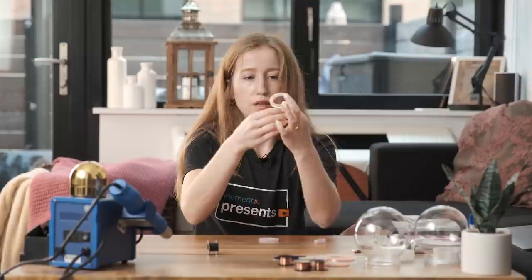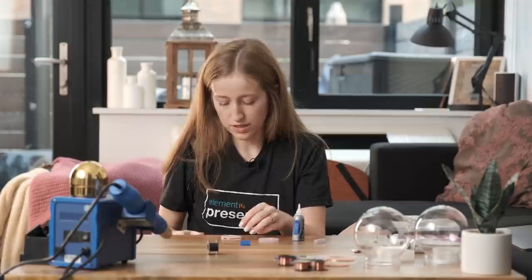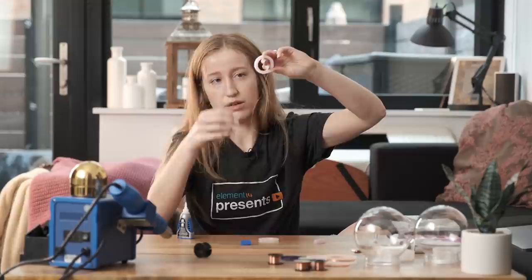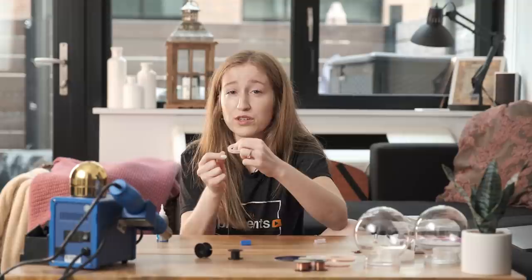Now I need to attach these — I'm just going to put a dot of superglue on each end. It's important to note that since it's an inductor in the circuit, you don't want to twist the ends together, because you've got current passing in on one coil and out the other — if you twist them together you'll short them. It's also important to note there is an enamel coating on this copper wire even though it looks bare. When you're shopping for the wire, it'll be called magnet wire, which denotes that enamel coating. I stuck my fingers together last time — not fun. There's probably a better way to secure the wire onto the spool rather than super gluing it, but I'll save that for version two.